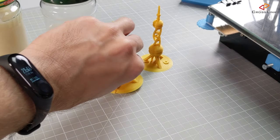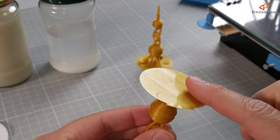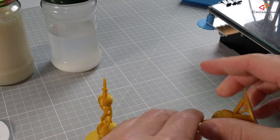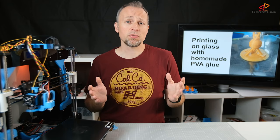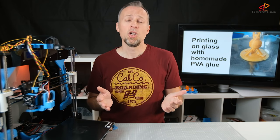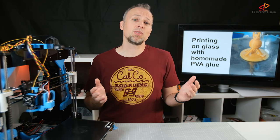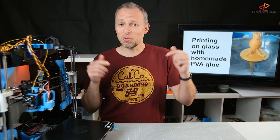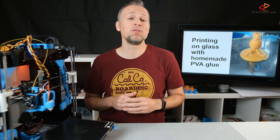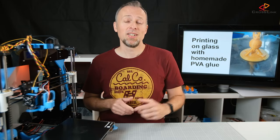Let's look at the final results. Both test tiles have a really nice bottom surface. The glass plate creates a really shiny flat surface, while the Anycubic Ultra Base has this interesting and still very soft pattern I also like a lot. Both surfaces had enough residual adhesion after cooling down, so the glue definitely helped increase the stickiness to the surfaces. I'm interested how this works for you, so please put your results using glass surfaces in the comments. If you think this was helpful, like and subscribe, and if you really want to support me creating new content, check out my Patreon page. See you next time!